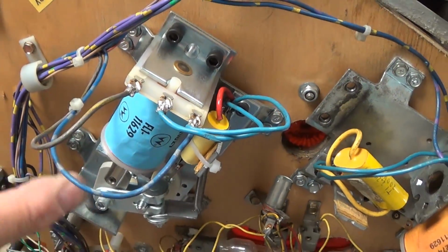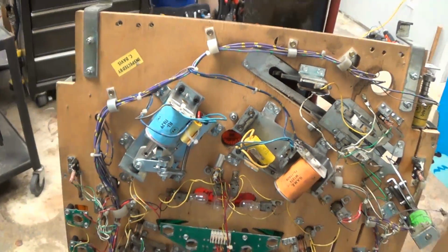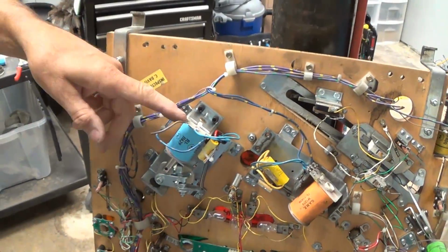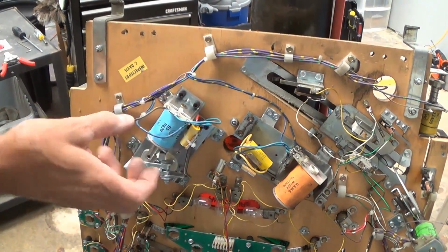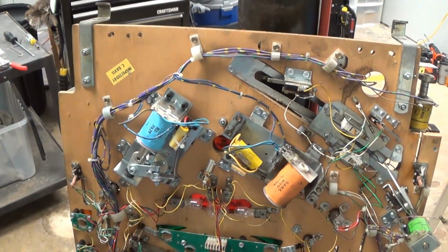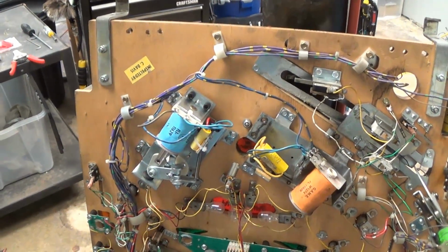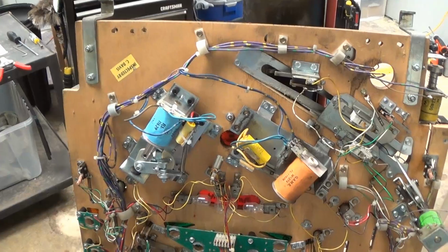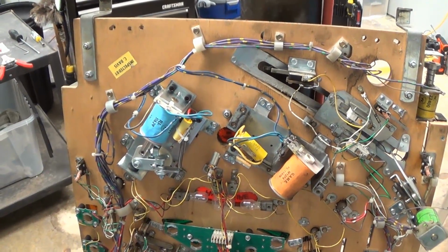Soldering is really the only way. This mechanism goes through a lot of bangs and vibrations during play, and they get loose and fall off. A lot of times even the wiring breaks itself. Well, we see that in a lot of locations, like Gottlieb flipper buttons. Right. If you don't do it this way, you're going to shorten the life of it by a lot.